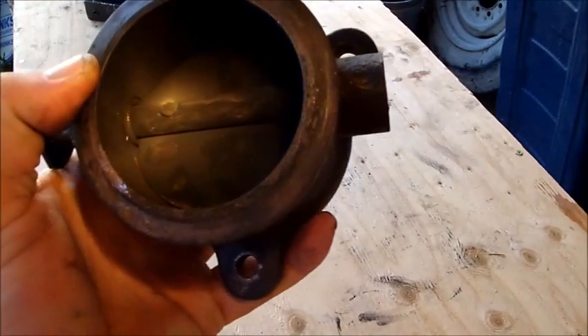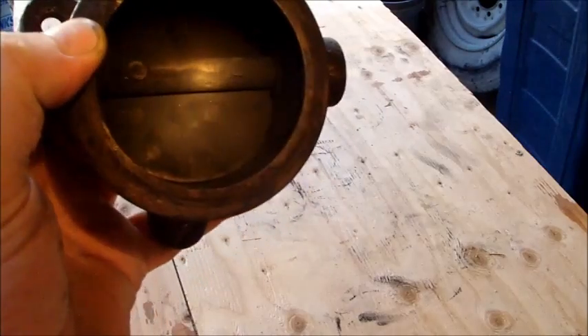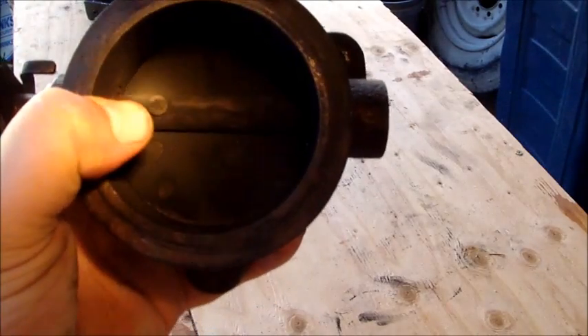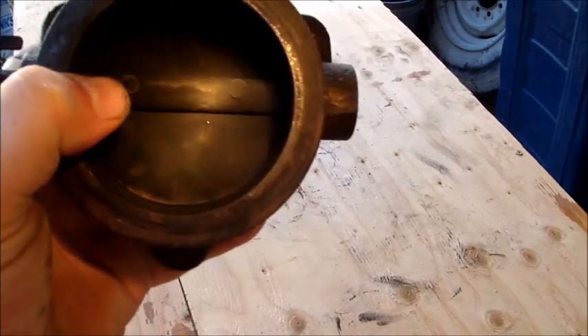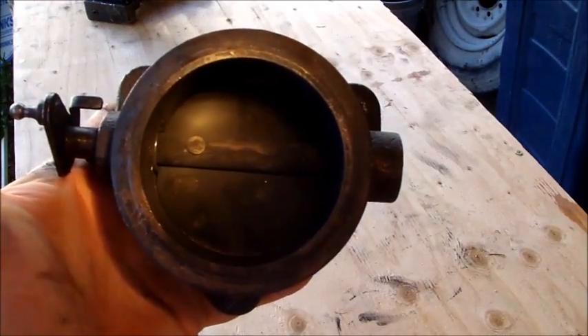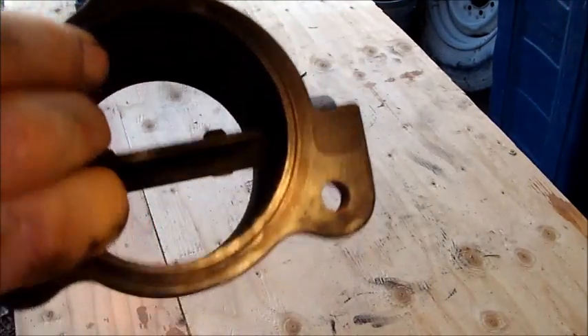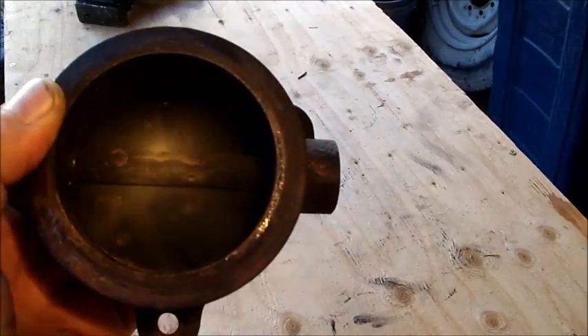It comes on according to oil temperature — when the motor is cold, it turns. So what we're going to do is, right there at the end of my thumb there's a rivet, and there's another one right down the shaft. I'm going to grind those off with a Dremel tool, and this fin will pop right off the front after I grind those two rivets off the back.